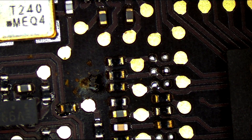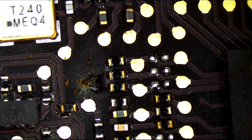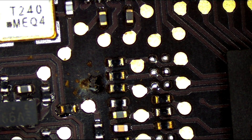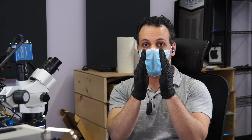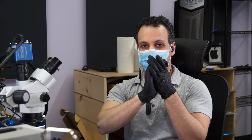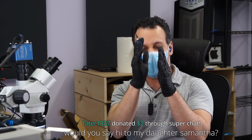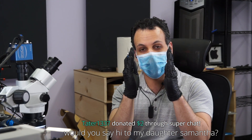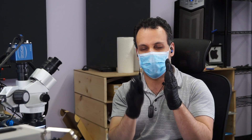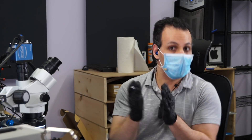Usually what we can do, if there's a short inside the board, I can scrape it out. So let's say you have two layers of the board with insulation between them — metal that conducts electricity on each side. If they burn up and start touching, I can take my knife and chop in there to separate them and cut off all the crap in between. But here I can't do that because it's all the way through the board — not just the two top layers, it's going all the way through.